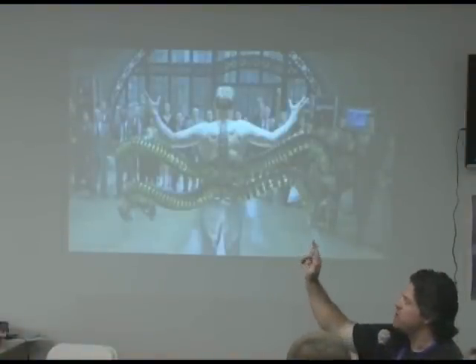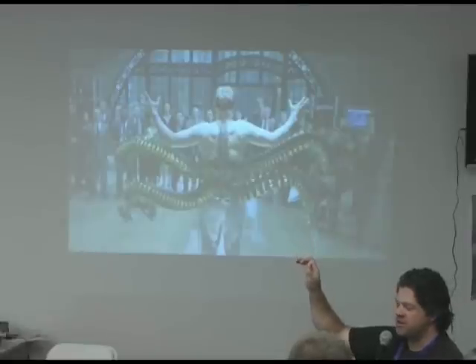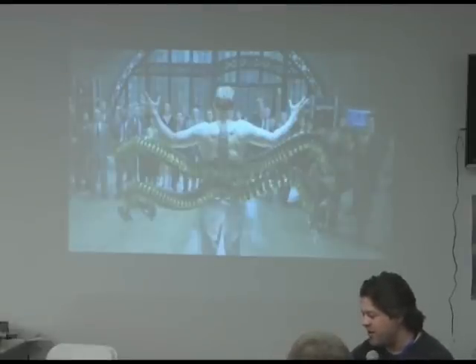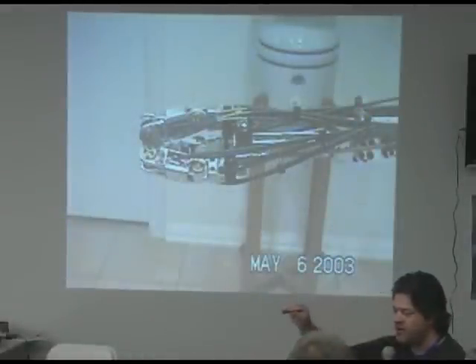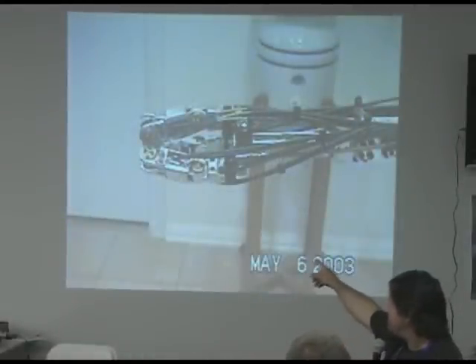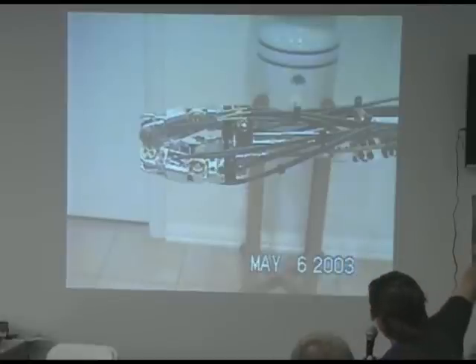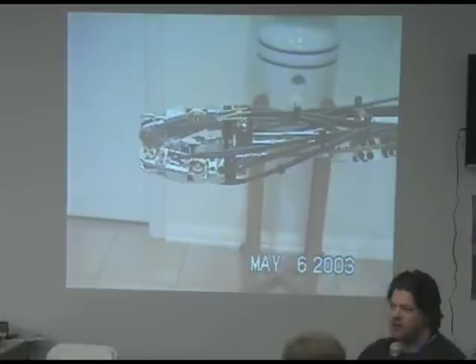Inside the claw is a smaller set of fingers that pop out — kind of like human fingers with three joints that fold into themselves. It's impossible for a human operator to unfold those, so the stamps were perfect for that. This is the hand that comes out. Each section between the two brass pulleys is the base of the finger, and the two other sections are folded within that. The servos are back about six feet, with cables running through cable housings.